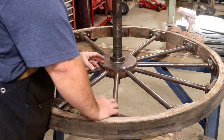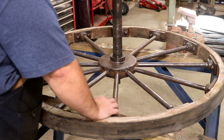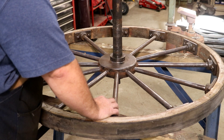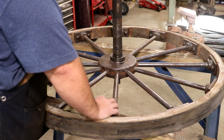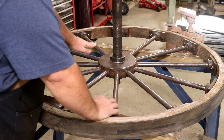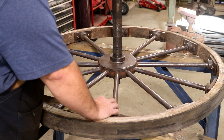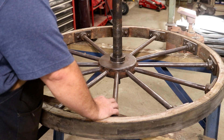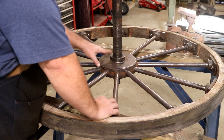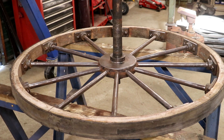What we're going to do is just drill and bore this thing out. I like that a lot better than beating on it or putting pressure on it and risking breaking this hub. I think we can remove that shaft by just drilling it out — that's the safest, easiest thing to do. We're going to get this shaft cut off and take it over to my radial drill where I can set this thing up and drill it out. Some of you suggested using my mag drill, but this will fit on the radial drill much easier with a lot more control. Hopefully by the end of the day we'll be able to do some detective work once we get that thing out and see what's going on.